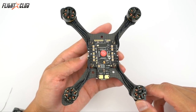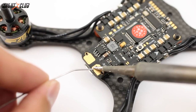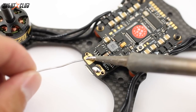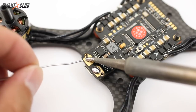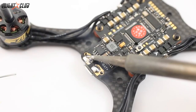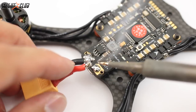This is what it should look like once you have your motors mounted. Next we'll just install the battery cable onto the all-in-one. The ground is always a little bit harder to do because there's a lot more copper throughout the whole board, so you just have to heat it up a little bit more. The trick is to add a lot of your own solder. Make sure you pre-tin your battery cable before you try to do this.